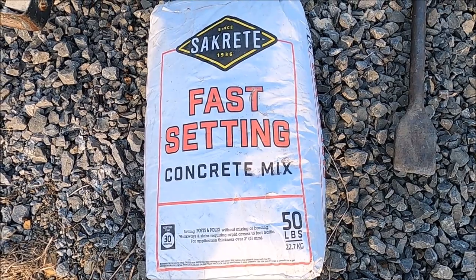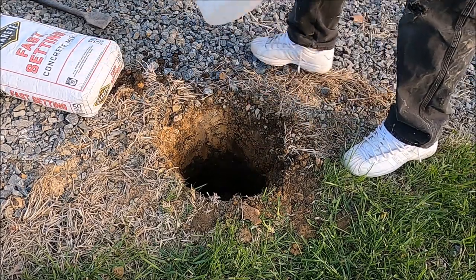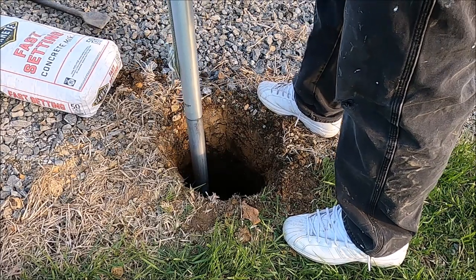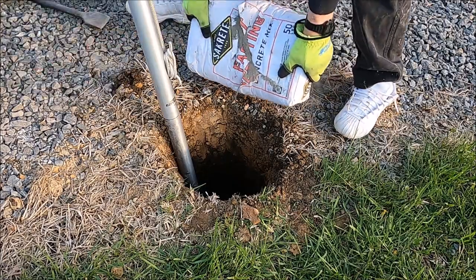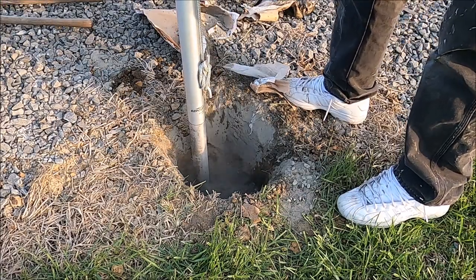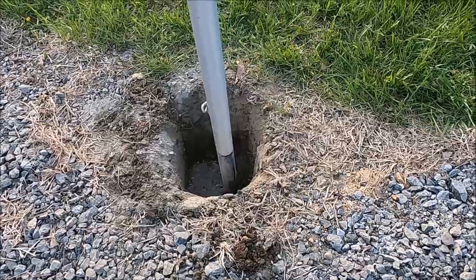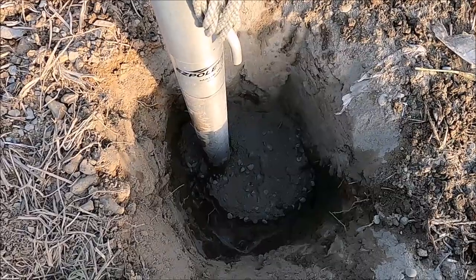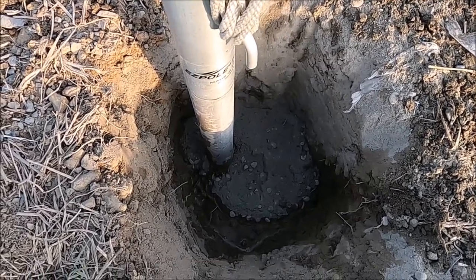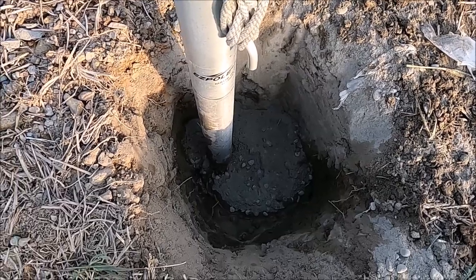I've used this a lot on railings and fences and things like that in the past. Instead of filling the hole one third of the way with water I just threw a bucket in, because I'm only using one bag of concrete. You can see the concrete's getting saturated, and even that one bag is holding this pole in place pretty well. I'm going to mix up a couple of other bags of the normal kind of concrete since I only have one bag of this, and then get this thing set perfectly level and wait for it to harden.